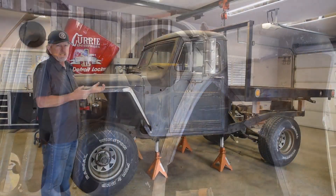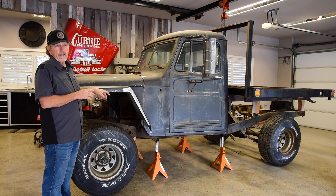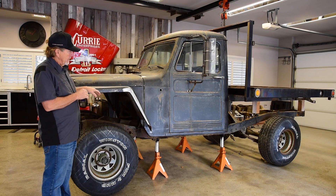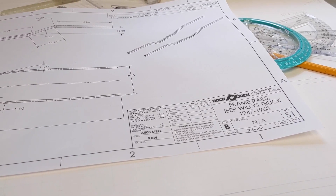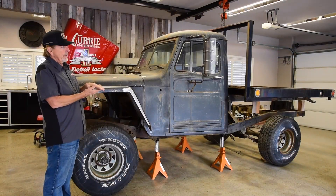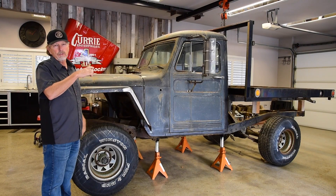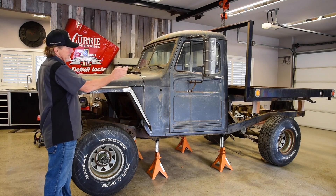The frame is basically going to be two by four square tubing, like 188 wall, front to rear, and then under the cab it's going to be two by six square tubing. It'll be a one-piece bent frame, reinforced under the cab with a piece of two by two. So under the cab it's two by six, and the rest of it is two by four.